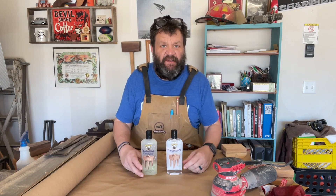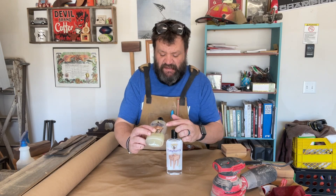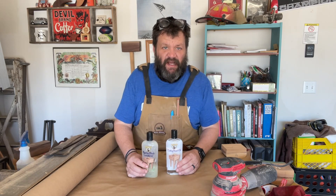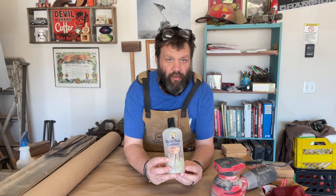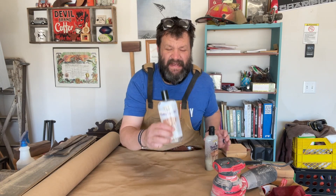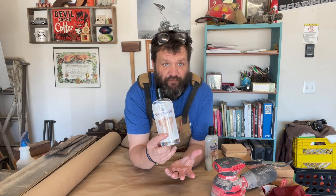Let's talk about the products. No brand loyalty here — Howard's is kind of the easy one you can get at most big box stores. That's why I'm using it; it's about ten dollars. There are two types to think about: mineral oil, and mineral oil with wax. I like to start with the wax version, especially on a cutting board, and then maintain it with mineral oil. Most importantly, whatever you're going to use, make sure it's food safe — all of these are going to be touching food.